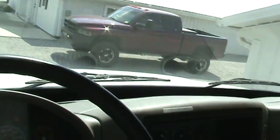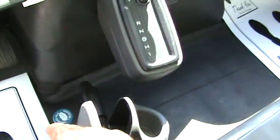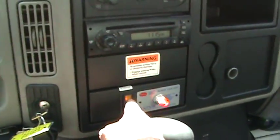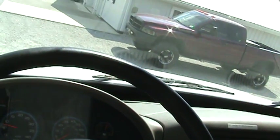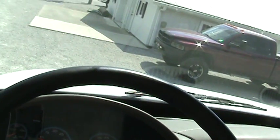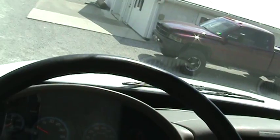I'll fire it up here. Brake controller. I've got the PTO engaged. There's the strobe safety lights. You've got to set it up on 1,200 RPMs to run the hoist, which I'm running right now. The button control for the hoist is right here. I'm going to run that hoist up just a little bit.